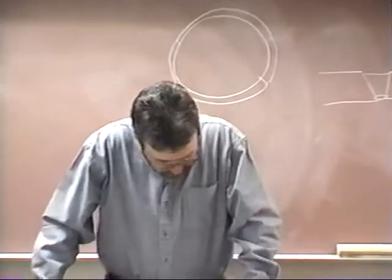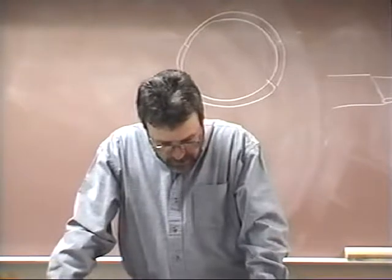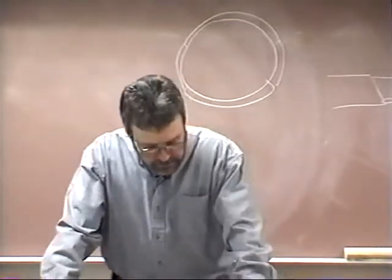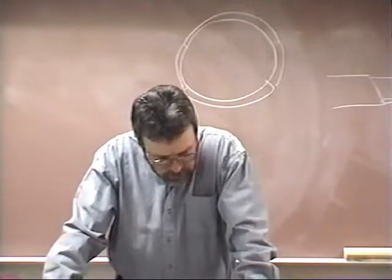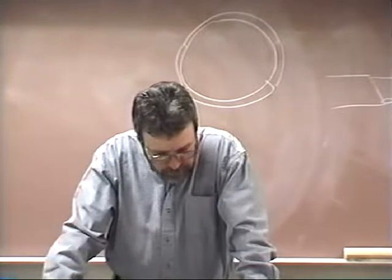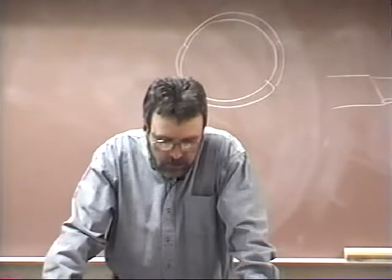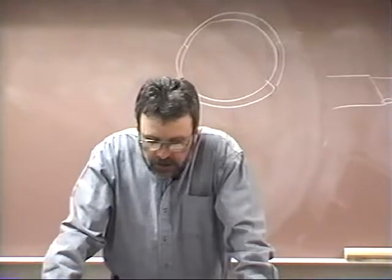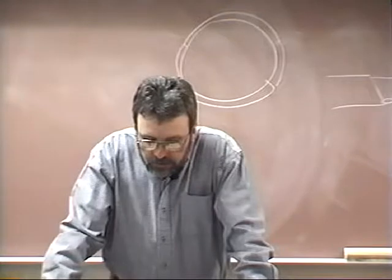Okay, your cover pass. The cover pass must be a bead with a neat appearance and having a slight crown, and again, the author's saying about a 16th of an inch, to reinforce the weld joint. The electrode, arc length, and electrode angle will be the same as those used to weld the intermediate passes. Two slightly different weaves, as shown in figure 8-29, are used to weld the cover pass. In each case, the weave must be wider than the previous beads in order to cover the weld joint.